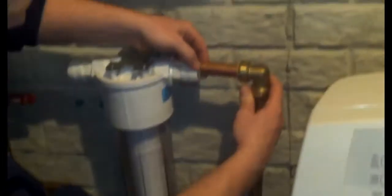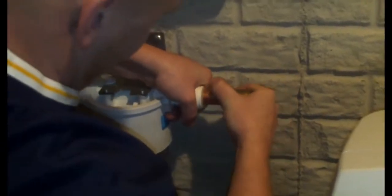We've already measured our pipes. I'm going to show you how to use these quick connect elbows. There's just a little ferrule in there — you're going to push the pipe right in. Make sure it seats all the way; you can kind of hear it and feel it click into place. Take the other one, put that in, and feel it click. Those fittings have little teeth in there in the O-rings so they won't leak on you. Push in, feel it click. Last elbow — put it onto this pipe. Done.